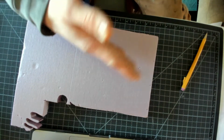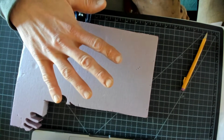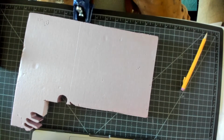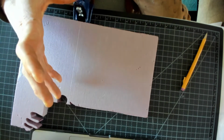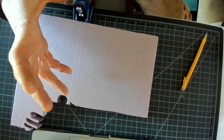You can coat this with a real thin layer of just white Elmer's glue and then stack layers on top. Press them down tight, put some masking tape around there so that they don't slip or slide while they dry. And in a couple hours, you can take the masking tape off, and something that's a big huge cube could be sanded down into a softball shape in minutes, right?